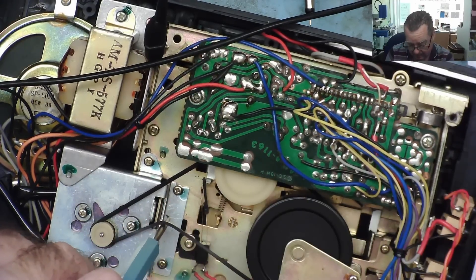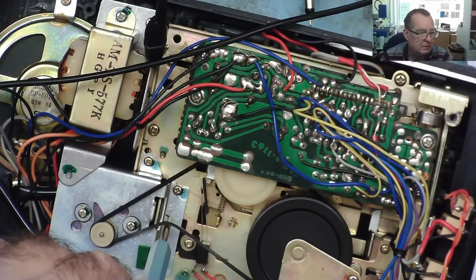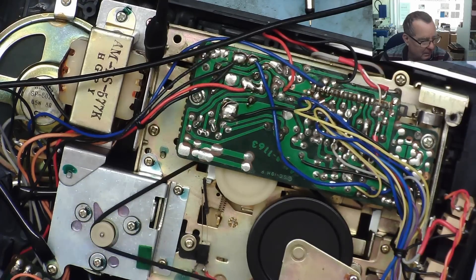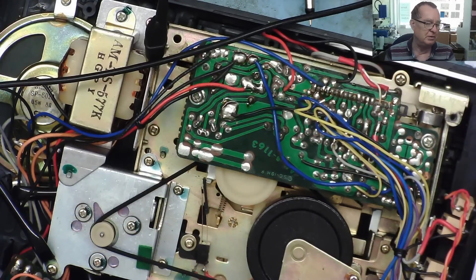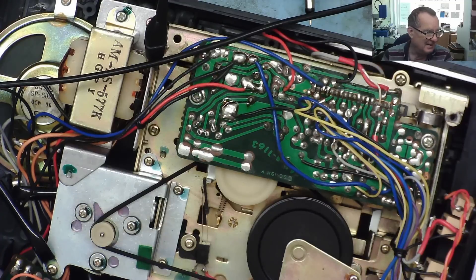Let that dry out... okay, it's dried out now. Let's see what it does - putting the power supply back on. The motor's spinning - is it making that howling noise? No! That's fixed the howling noise. It makes sense - this switch is switching between record and play, and if one or two contacts weren't making, the circuit would be simultaneously in record and play mode, or just not connected - you'd get that sort of feedback. That makes sense. Okay so it's working. We need to solve the problem with the elastic band, and somewhat the problem with the noise.